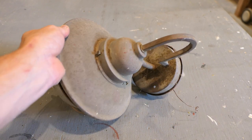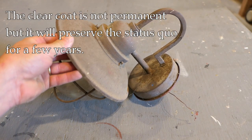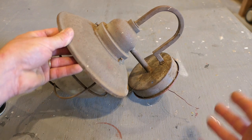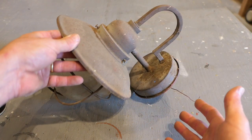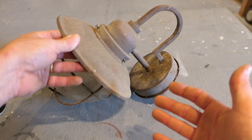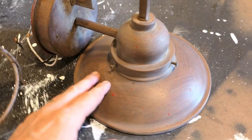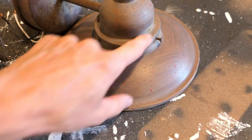I want to point out this is not a permanent solution — it's going to buy you time. If it's really heavily rusted, clear coating may get you another year or two. If it's moderately rusted, you might get four or five years out of it. The rust will eventually take over, but what we're trying to do is clean up the surface, get the really scaly stuff off, then clear coat it. That will prevent the rust from getting any worse and prevent rust stains from dripping down and staining the siding of the house.